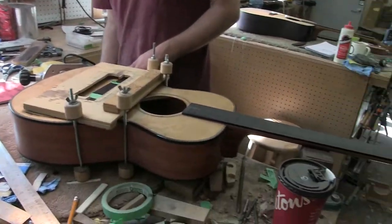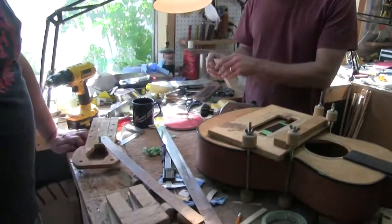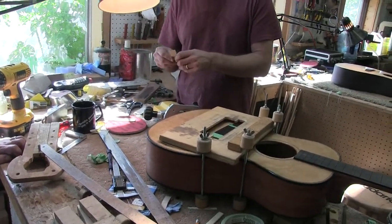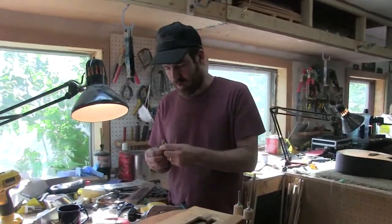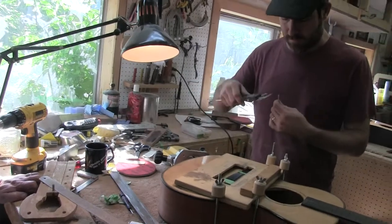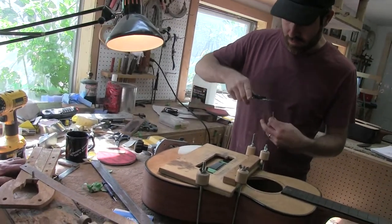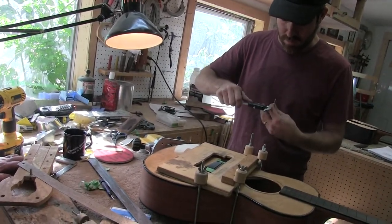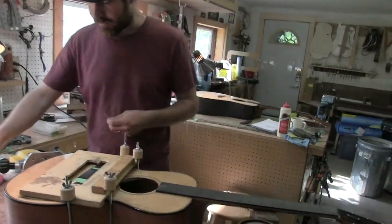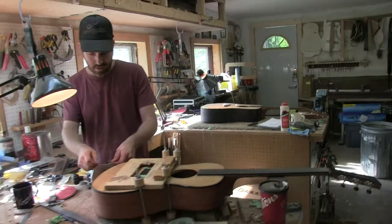now I've got a teeny tiny little itty bitty baby slot, and it's not big enough. So what I'll do, take 3 veneers. These 3 veneers together are 48 thou, and that's a 50 thousandths of an inch channel.